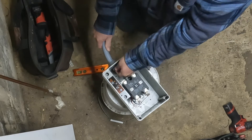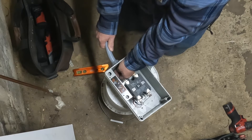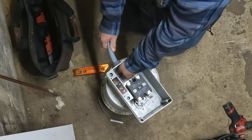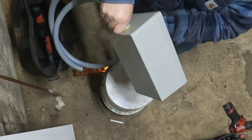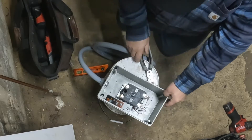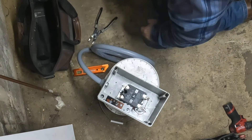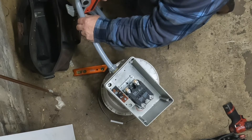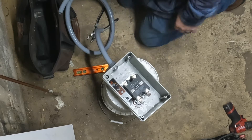I'm going to put this in here first and get my lock nut on nice and tight. Then I'm going to get a rough cut of the flex — it's not going to be very long, probably like six or eight inches — so I'm going to cut it right now, and then I'll get my exact measurement.